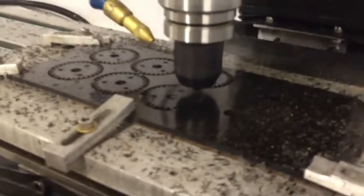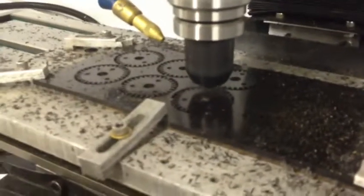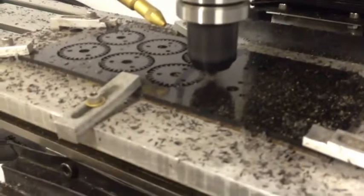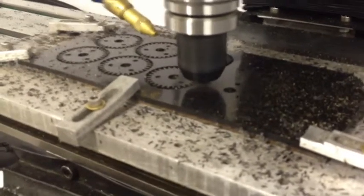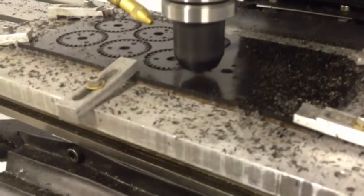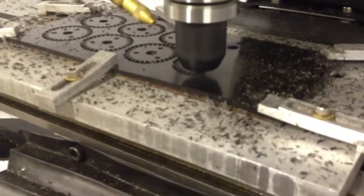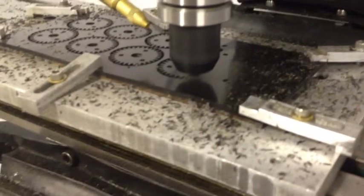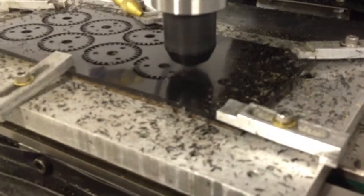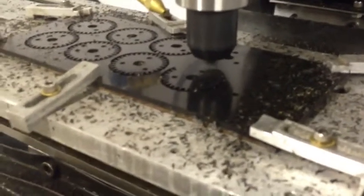This particular part I run ten at a time because that's as much as I can get on the X2 with clamps in the fixture and whatnot. It looks like I could probably add at least one and maybe two more rows, and probably double the number of columns — so I could probably quadruple it, go to 40 parts per run, which would just save me a lot of time in terms of fixturing, cutting material, and just letting it run.